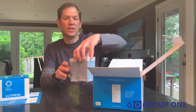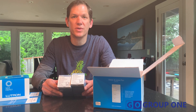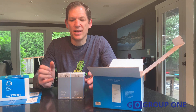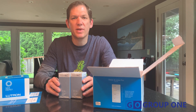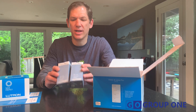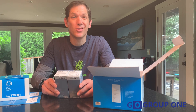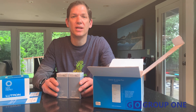Also in the package are two dimmers so you can get started before you begin adding every other light in your house once you realize how nice it is to have. The Pro dimmer is nice because it allows for forward phase or reverse phase dimming — it's really the Swiss Army knife of dimmers that will allow you to control pretty much any dimmable lighting load in your house. One nice thing about the Select product is that it looks like a regular Decora light switch, so from the standpoint of filling your house, it's a very easy transition for the users.